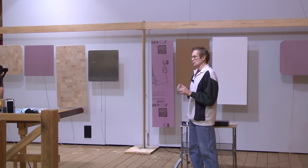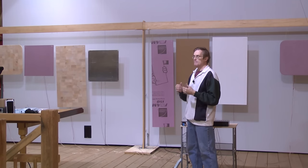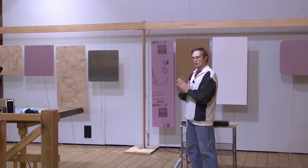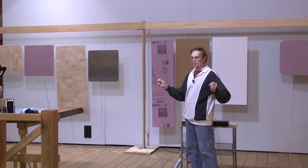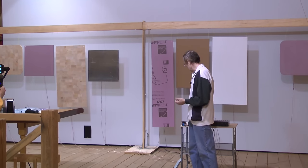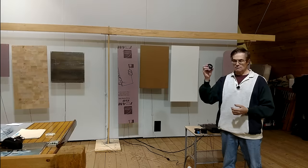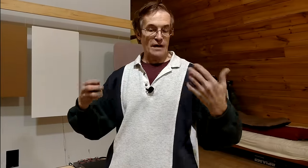One of the things the manufacturer recommended when building speakers like this is to use a material that has very high compression strength but very low bending strength — in other words, very flexible in bending but very stiff in compression. That stiffness in compression makes sense because you're not going to couple a lot of energy from a small module when it's attached to foam. But you also want something that can flex, bend, and vibrate to produce the sound.